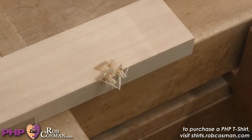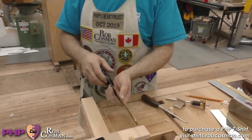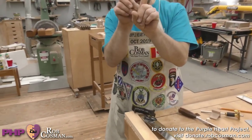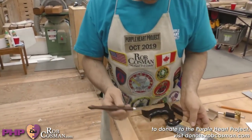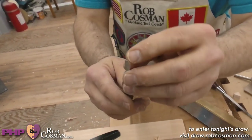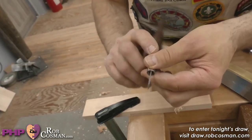Right? So the crosscut saw, instead of having teeth that are flat across the top, has three-sided teeth that are pointed. And each one of these points, one points this way, the next one points that way. This way, that way, this way. So the crosscut teeth come in, well, let me show you that shape. Okay, so that's one, two, three-sided. See, one, two, three. Can you imagine teeth like this?